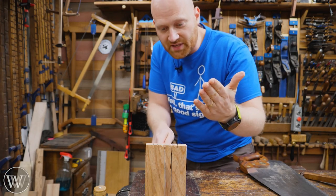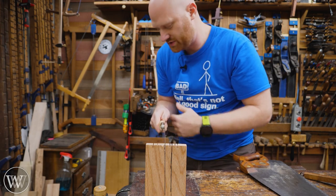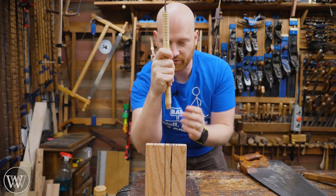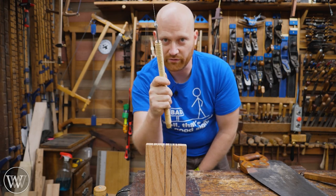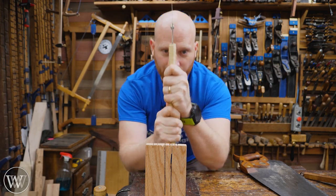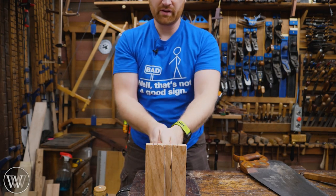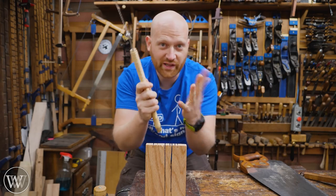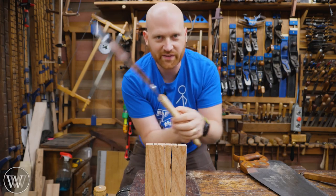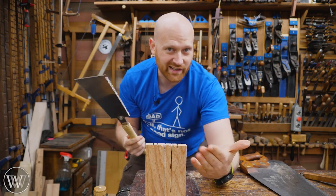With a Japanese saw, you can cut with one hand — in which case the saw needs to be in line with your arm, wrist, and shoulder. You want to make sure you're holding it with your wrist above the saw rather than to the side, or it's going to cause you to go all over the place. The cool thing about Japanese saws is they're intended to be used with both hands, like a golf grip. You put your belly right in line with it and pull towards yourself. Using two hands means they kind of self-correct each other: if one is pulling too hard, the other pulls back, working together to give you a really nice straight cut down the board.